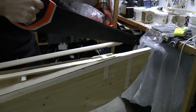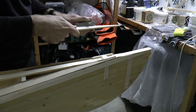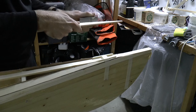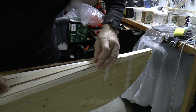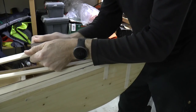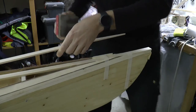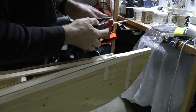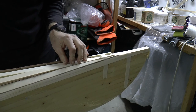Now I can start facing the first strip on the side. This strip is also a bit difficult to fit. With a small hand planer I smooth the edge, try it in between, then take off some more to try to face it to follow the deck line. I finish with some sanding to reduce the gap from unevenness in the planing. And now it fits.